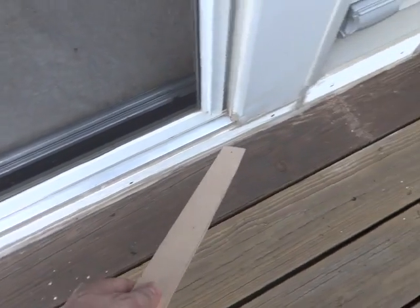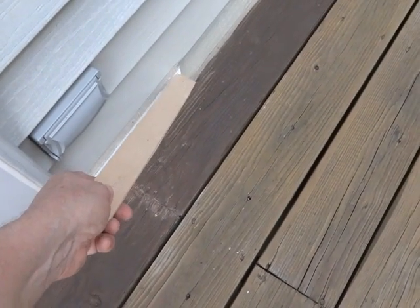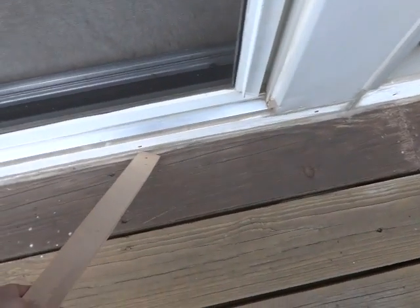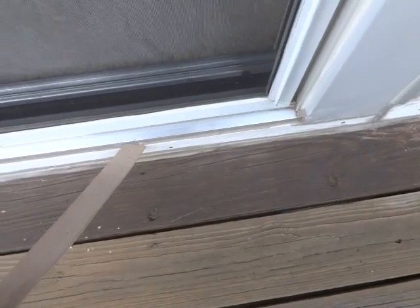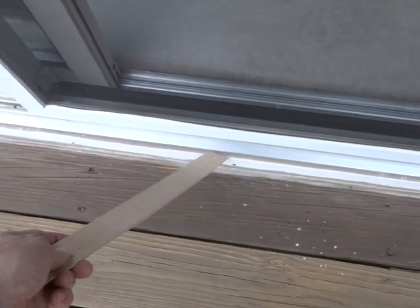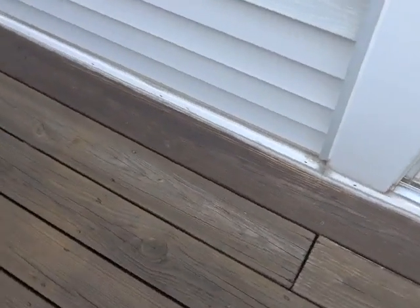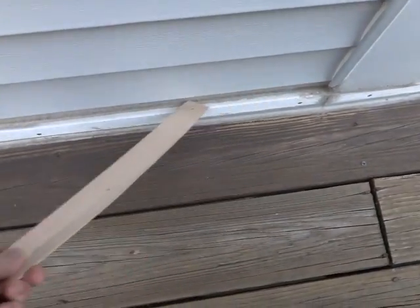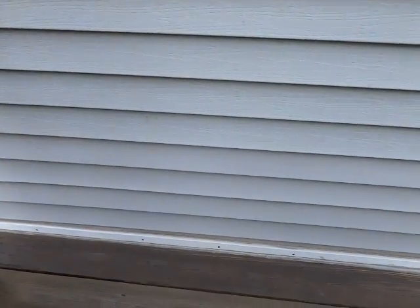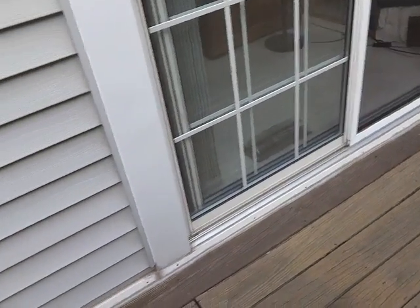All I did here is I took 3/4 inch, because this was 3/4 inch, to be able to match up to that siding. So I thought, okay, let's make it 3/4 inch all the way along, but it sticks out a little bit here. I think I can get the ACQ wood underneath that, and then this, I'll do siding here, and so then that should be good.